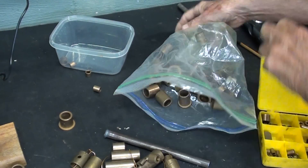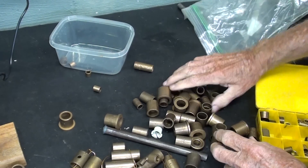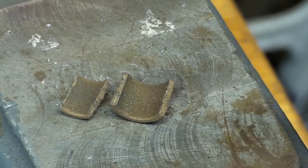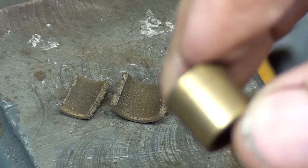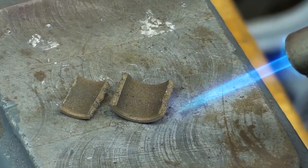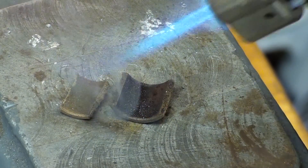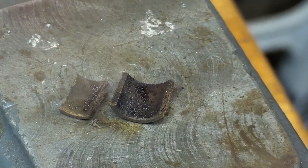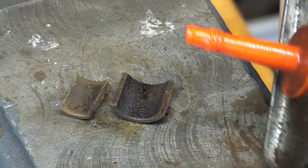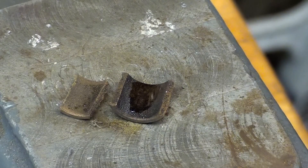Here's yet another selection that I have in stock, always saving for the right moment, which never seems to come. I sacrificed a bearing and just crushed it in the vise — it took almost no effort at all. Playing a flame on it, you're going to see very quickly that the oil will start to burn out. As a matter of fact, they actually burn — it's not the bronze burning, it's the oil of course. After they cool off, a fella could re-oil them and the oil would get absorbed back into the sintered bearing.